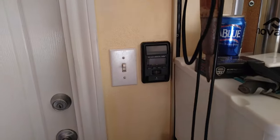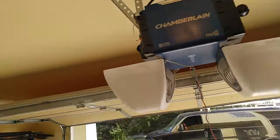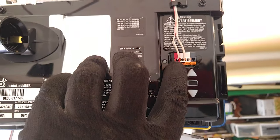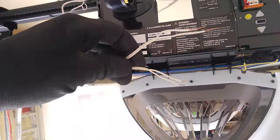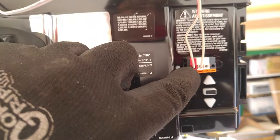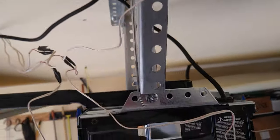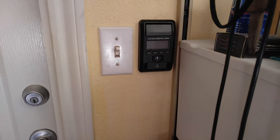I'm going to come over and check my wall button — there's no light on it, it's not on. So that's going to tell me those two wires are not it. I'm going to unplug those two wires, wrap that one up so I don't grab it again, and try one of the remaining two. I plugged in one of the two remaining wires, red in the red and white in the white. Let's go see if the wall button light is on — nope, it is not on.